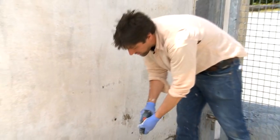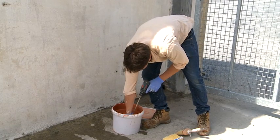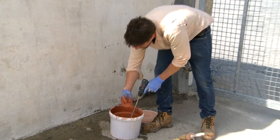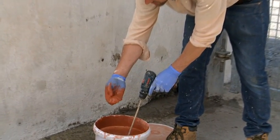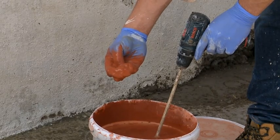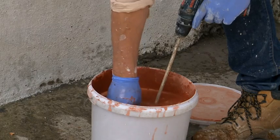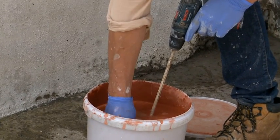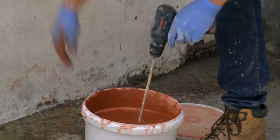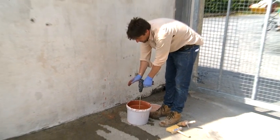I'm going to drill this up. Deep in here, if I put my finger in, I'm pulling out a sludge. This hasn't got any sand in it — this is just lime putty mixed with pigment, mixed with water. The water is sitting on the surface and the actual particles of lime and pigment have settled on the bottom of the tub.